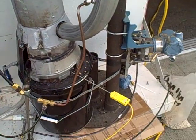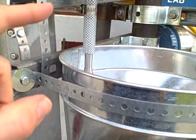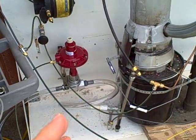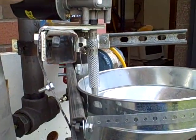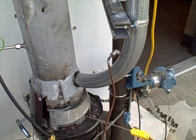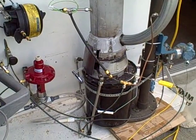Now we don't think it's an actual wiring problem with the thermocouple because it seems to correlate with the running of this auger. When we don't run the auger, it doesn't happen — it's only when we run the auger. So we think that perhaps the thermocouple circuit is picking up electrical noise from the power being fed to the auger motor, and that might be the cause of our problem. We'll be doing some more investigation later on to find out exactly what the problem is, but we think we're on the right track.